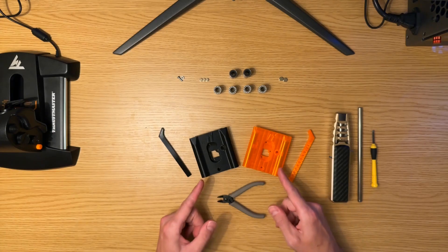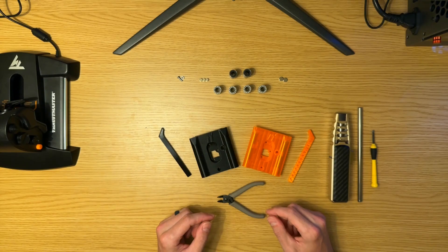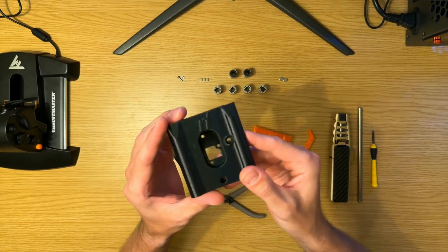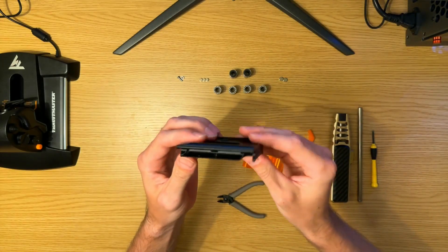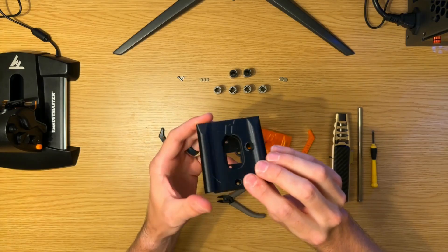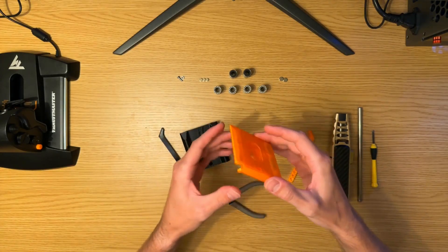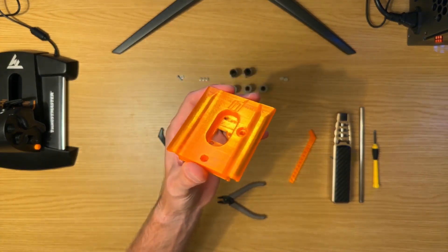What I have here are two impulse slider mark threes with their associated hockey sticks, straight off the printer. You can see that there's a little bit of stringiness to them — just some stuff sticking off. That's just a product of the material type that I use. I use PETG now, as I live in a much more humid climate than I'm used to.